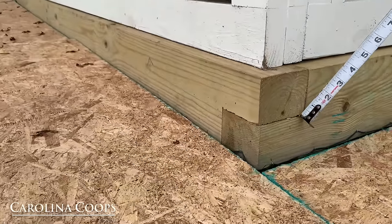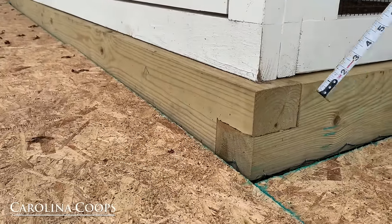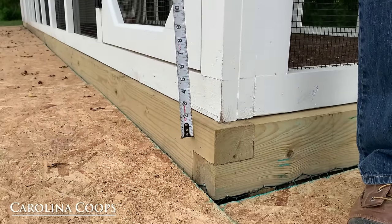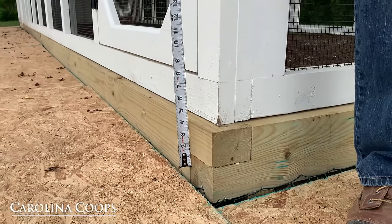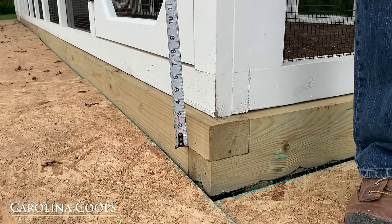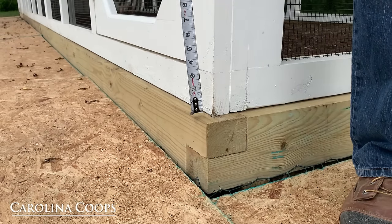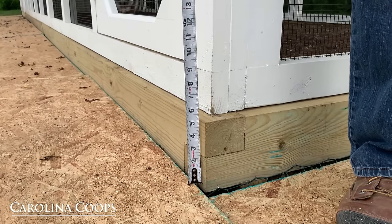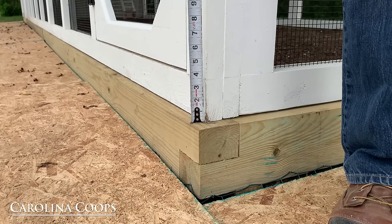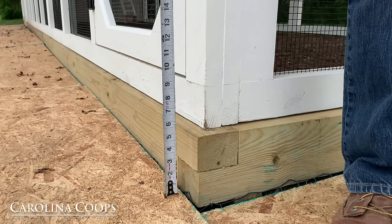And it's the strongest form of joinery, in this case with a pressure treated base, versus if you just butt the piece of wood to another one with the complete width of the board and you just lag it together, you're relying on those lags to hold all that weight, versus all the weight sitting on top of one another. And also, you can't see it right now, but we pin it with rebar that goes all the way through both pieces of wood and into the ground.